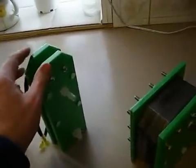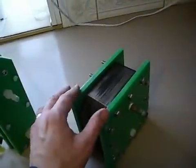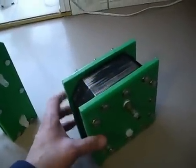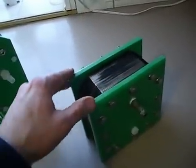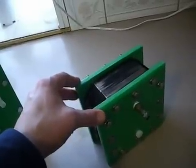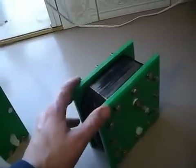But this one still didn't use that much. At 20 amps, it produced just over 1 and a half liters a minute — something like 1.55 liters per minute at 20 amps, 12 volts, bubbling it through 68 degree water.